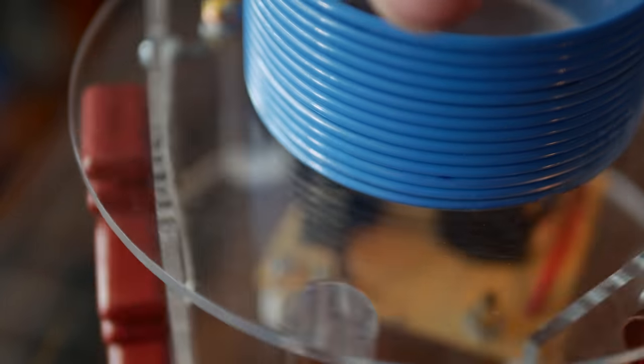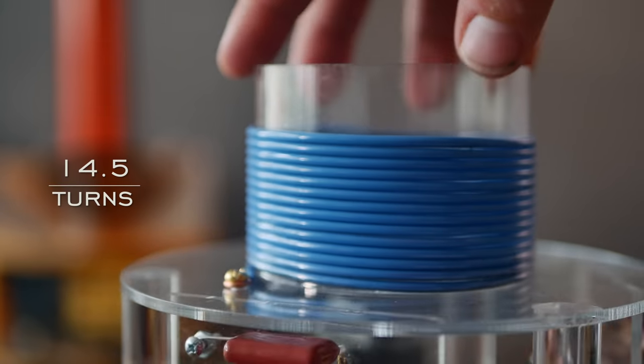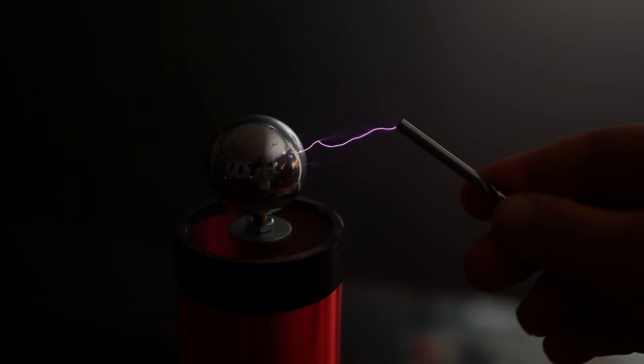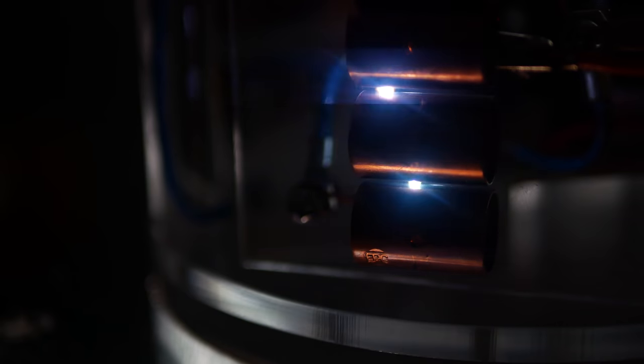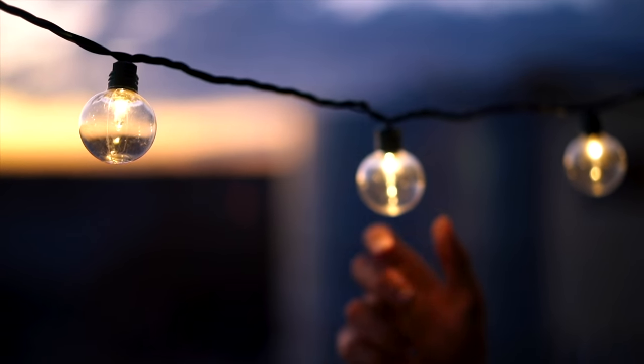These windings you see are spaced intentionally about a half an inch from the edge of the acrylic for added insulation, because what goes inside of this acrylic will be pumping out close to about 100,000 volts, the secondary coil. This is a second coil of wire responsible for converting the electromagnetic pulses from the primary coil back into electricity, but at a much higher voltage.